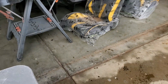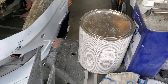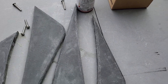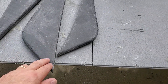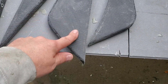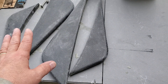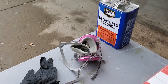What I've done is — last time you saw, these were in the bag. Basically, I've put a couple of coats of epoxy on and done some sanding. I've spared you from the sanding. We're just going to flat this off, and then we're going to try to get rid of some of these little pinholes by blowing them out. Once we do that, we'll go with the denatured alcohol and clean them all up.